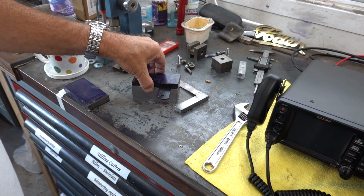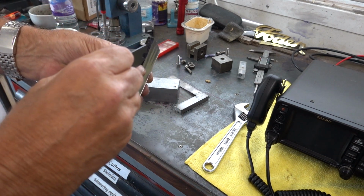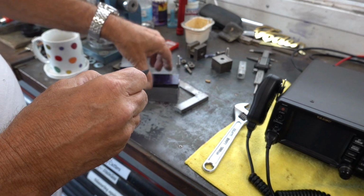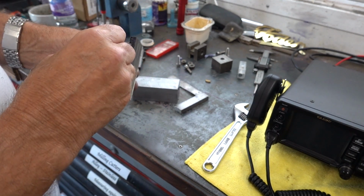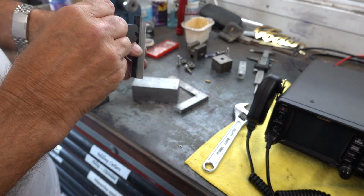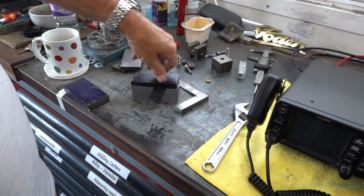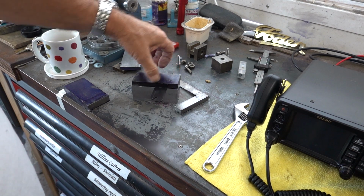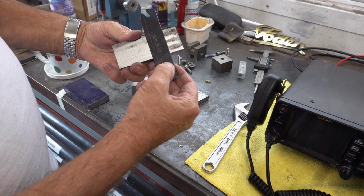So the next job is, well, can I use that? If I machine some of that away and then pinch it with 4 bolts, is it going to bend it? Because I'm not quite going the depth of that. Like I said, that's going to stick out a bit, so it'll press hard on the side of there, which will give you your locking idea, so it can't move. And as I say, it can't move that way because it'll be cut into there with a little dovetail at the bottom that it sits in. So